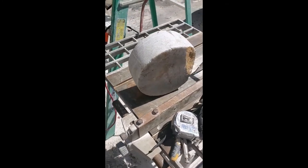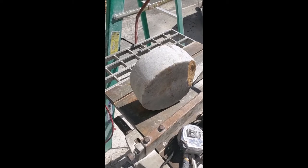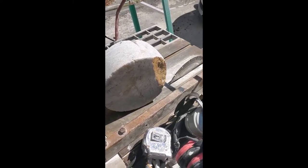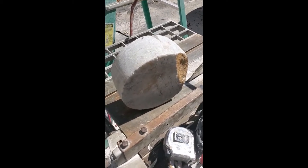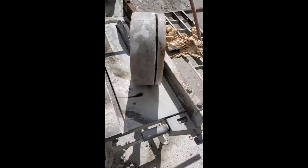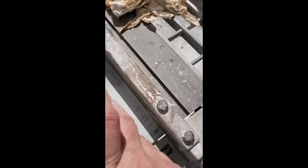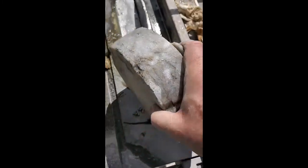I got both stones cut and round. This is going to be the stationary bedstone - I now know it's called that. As I was cutting it, a piece flaked off and you can see there's iron in there. So I'm going to run it against the fence and see if I can slice off down to there - the stone doesn't need to be this thick, I don't think. I've cut the width of the blade all the way around; it's still attached because it doesn't go quite through. I've cut beyond the piece that was broken, so I'm going to start tapping it with a hammer and hopefully it will do what it's supposed to do.